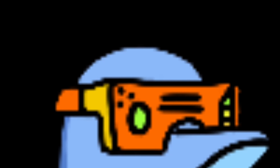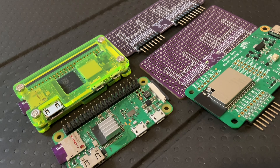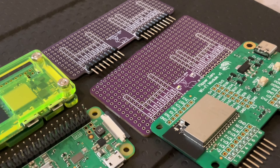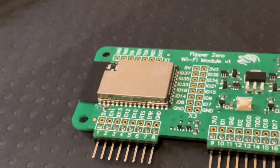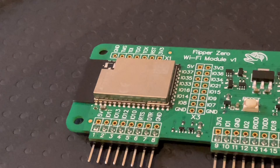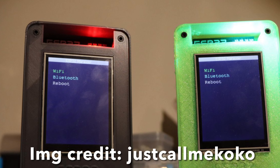After an entire year of backyard sciencing in the hands of maniac tech enthusiasts, we are getting some pretty nice stable third-party hardware for the Flipper Zero. One of those popular aftermarket accessories is a developer board. It utilizes the UART bridge on the Flipper to control a wide variety of hardware applications. The original Flipper Zero developer board has only an ESP32 chip, giving the Flipper 2.4 GHz Wi-Fi connectivity, originally meant for OTA debugging.